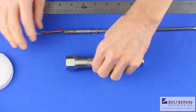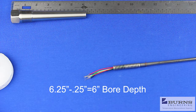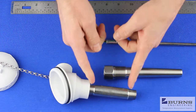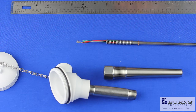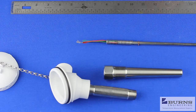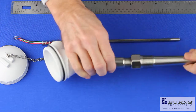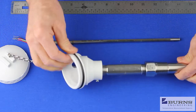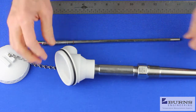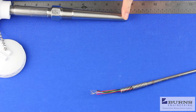Looking at a typical assembly head installed into the thermal well, we can see this probe is way too short. Taking a thermal well that happens to be the right length — measuring the overall length at six and a quarter inches gives us a six inch bore depth. The pipe nipple extension on this style assembly adds three inches to that bore depth number. So six plus three inches gives us a nine inch probe length, and that's the number you would use in our part numbering scheme.